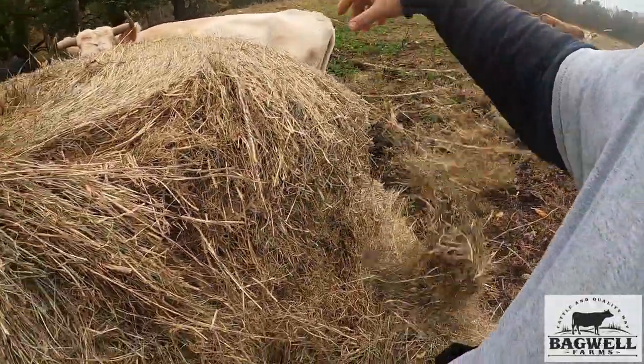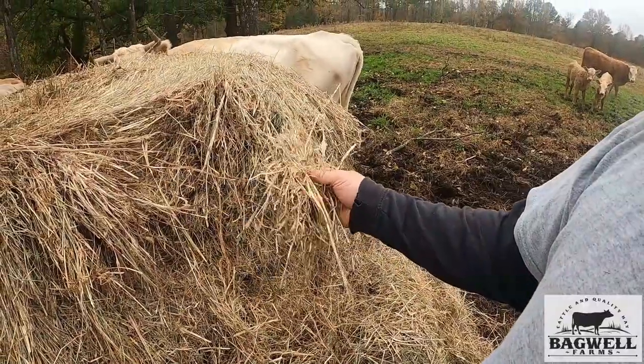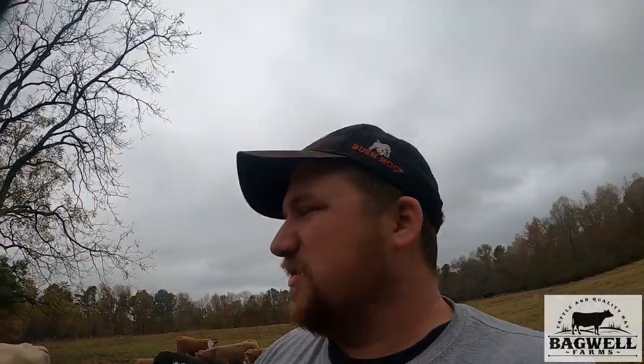See, it's not even cut over there, but on the inner part it is, which helped the bales look a lot nicer on the outer part, because when you slice them in a 2.5-inch slice, it's a real fine material and the bales don't look too pretty. I mean, it bales them good and the shape on them is good, but they just look rough on the outside. I don't like it. That's just my preference. So I pulled two of the knives halfway through to try it. One of those bales is cut on the ends all the way and the other one is not.